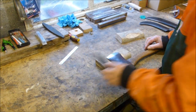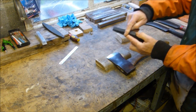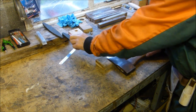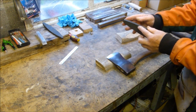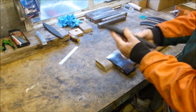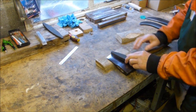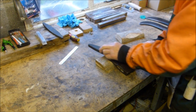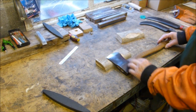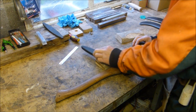Then how you do that: you sharpen it like that and use all the stone, as I told you before. Put it there, and there, and go straight through, so that when you finish the stone wears out equally. It stays horizontal, you don't get a bow in it, because as you come to the end of the push, you press so that it wears away there. You start about there and go straight through, right to the end. Then you do about 5, 10, 20 there, till you're quite happy. Then you can turn it over and carry on.